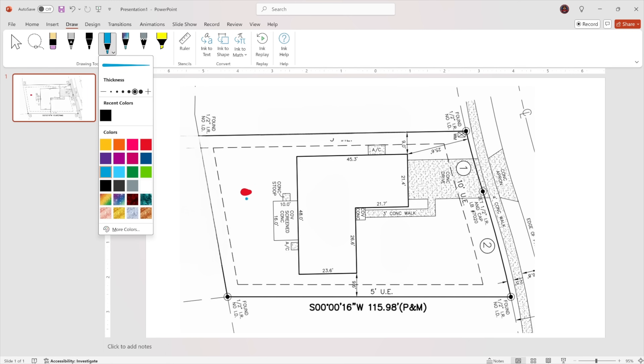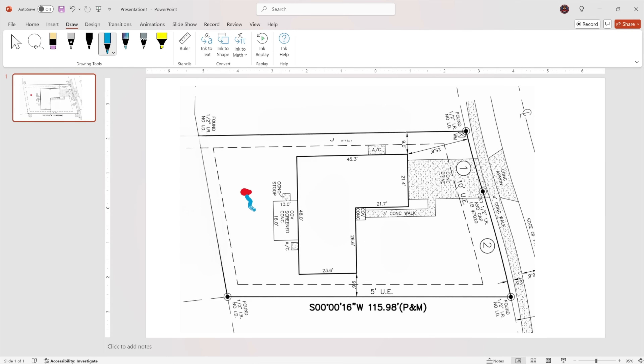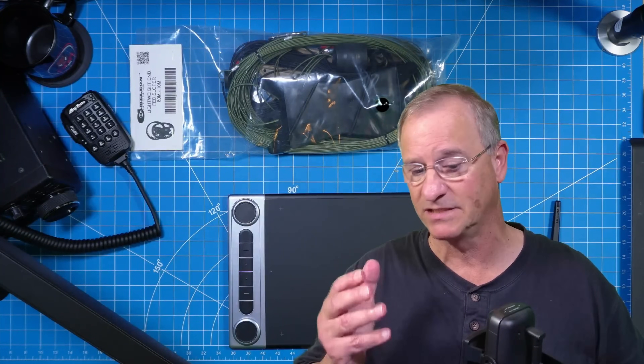What I want to do is see if I can do a sloping L and slope my wire in this direction and go down my side yard. I still don't know if that's going to give me the space I need for 130 feet. I may have to do something as crazy as turn the wire back on itself — I'll only do that if absolutely necessary. This antenna system has a very good reputation for performance, and when you can get a wire antenna up resonant on that many bands — wow. Add 80 meters and double wow.